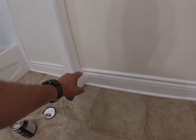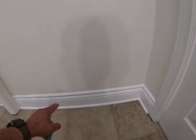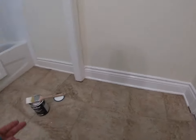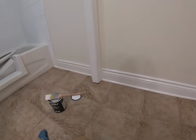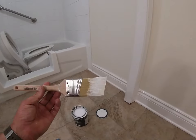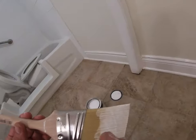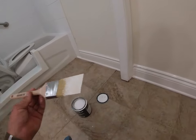This little section here at the top of the wall — I'm just going to hit it again to tighten it up. I'm going to fill these nail holes. Anyway, hope you enjoyed it and hope it helped. Again, it's an interior-exterior paint, semi-gloss. The reason I use interior-exterior is it dries quicker, and when you're done you can just wash your brush with warm water. Make sure you get it all out — even use a fork with the warm water to get all the bristles clean.